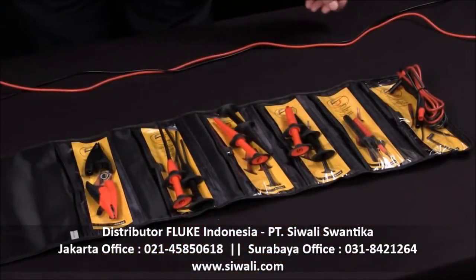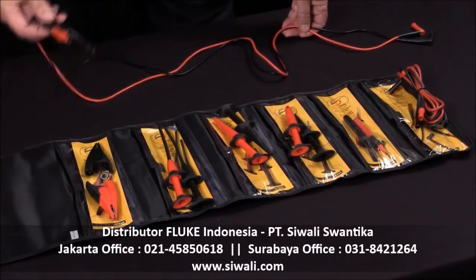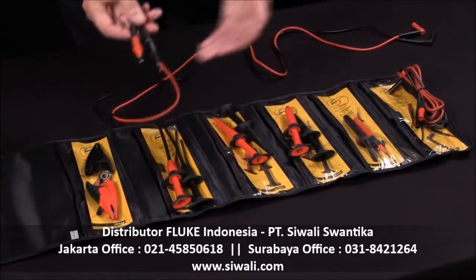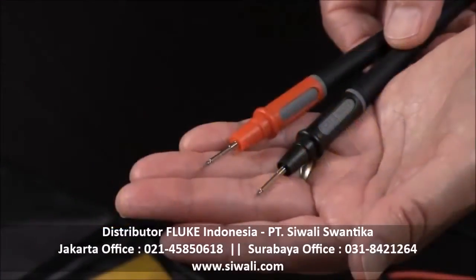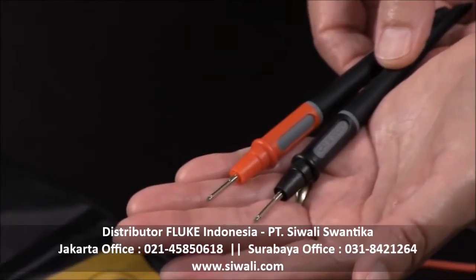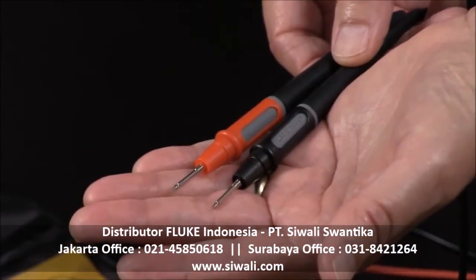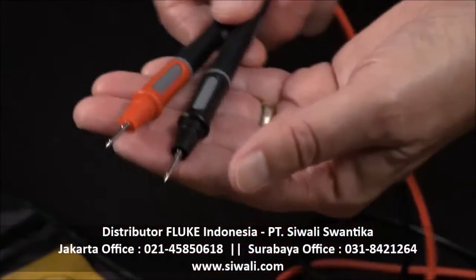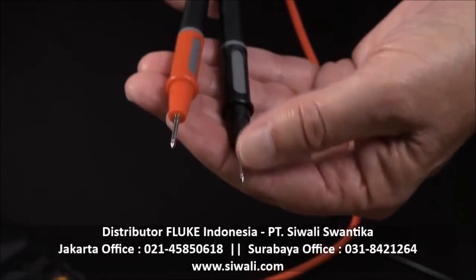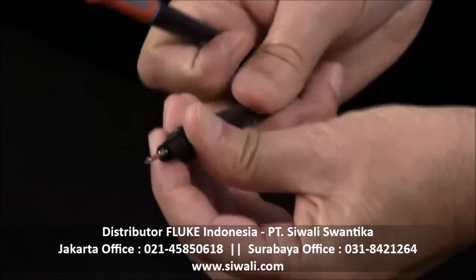Another new innovation in test leads is the TL-175. It has the traditional probe tips that have quite a bit of exposed metal for probing in different sockets and things. But when you get into a high-energy electrical situation, you need something with less exposed metal. In this configuration, these probes are rated Category 2, 1,000 volts. But they have a twist